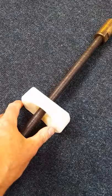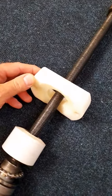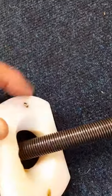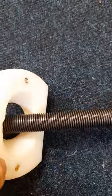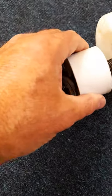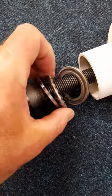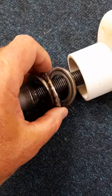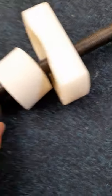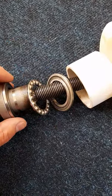Firstly, this is a composite part which we spoke about in an earlier video. Before I cleaned it up, this sits just underneath your table in the saloon, on top of the housing. There are two holes in it, and you use a stainless steel screw to screw it down onto the cover which surrounds the ball bearing race. You can see here the stainless steel ball bearings — they're in a cage — and there are two stainless steel races. You've got to keep an eye on these and make sure they're in good condition.